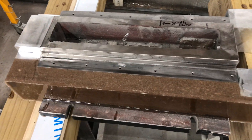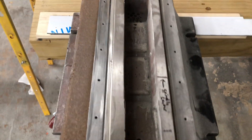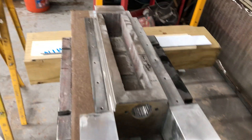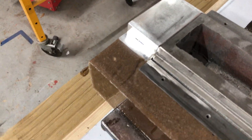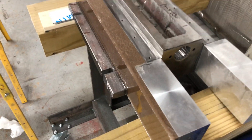Here's the face of the machine. I'm filling the sides up to the mounting holes with epoxy granite, all the way front and back, so it's going to connect this back space and be more solid. I'll do the other side tomorrow - it's going to be very heavy. Here's the result. Quite a bit more mass - very solid looking. Once I sand off the corner and paint it, it should look pretty nice. There's a little bit of a wrinkle in the vinyl I was using as a seal, but this is a good addition.